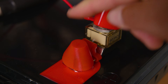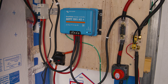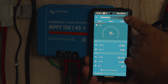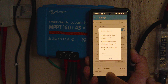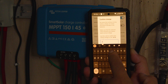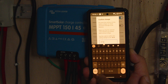You've done it — you now have a 24V system! Go ahead and turn on first the switch that powers your charge controller. A pro tip: always turn on your charge controller before turning on your solar system breaker or inverter breaker — this helps protect your system. When disconnecting, always power down the charge controller last. Now connect to the Victron app, go to the gear icon for settings, select battery, and change the battery voltage from 12 to 24.